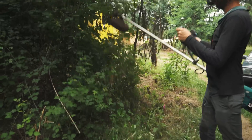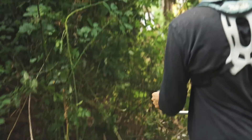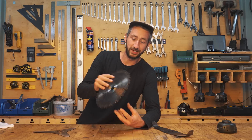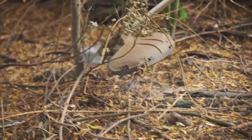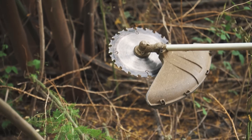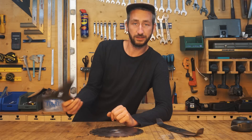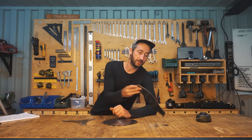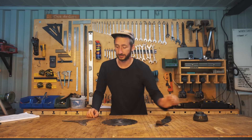That downward blade is a bit more aggressive but very effective for big brambles. We recently tried a circular saw blade — it feels very rough, just spinning out in front of you. I'm used to table saws where everything is fixed with protection covers, but this is mainly used to chop smaller trees and branches. The blade we use most is the triangular all-rounder since you can handle grass and thicker bushes. We also use the downward blade for big brambles, the saw blade occasionally, and the string cutter for grass — but that's standard brush-cutter information, not specific to the electric version.